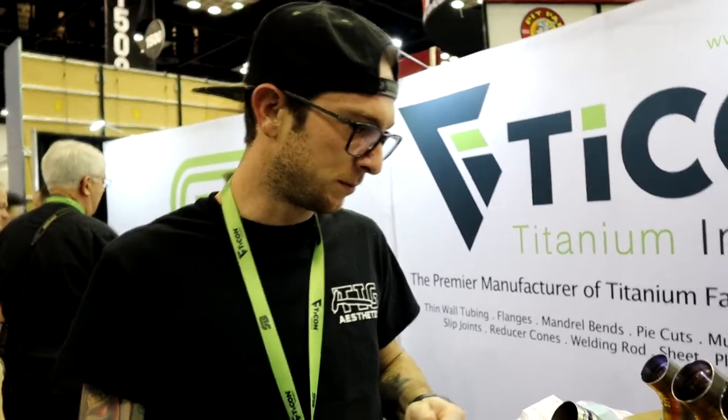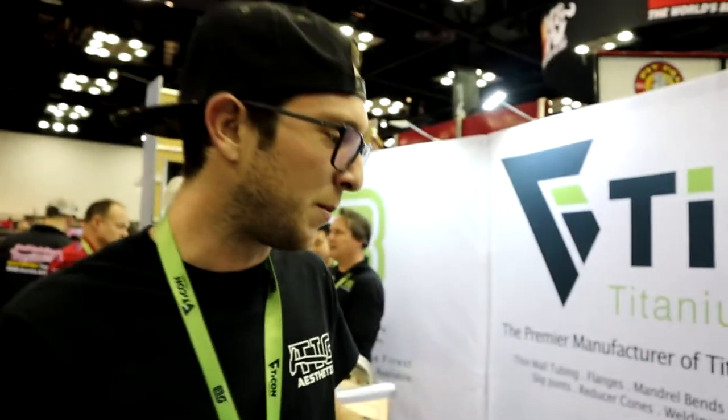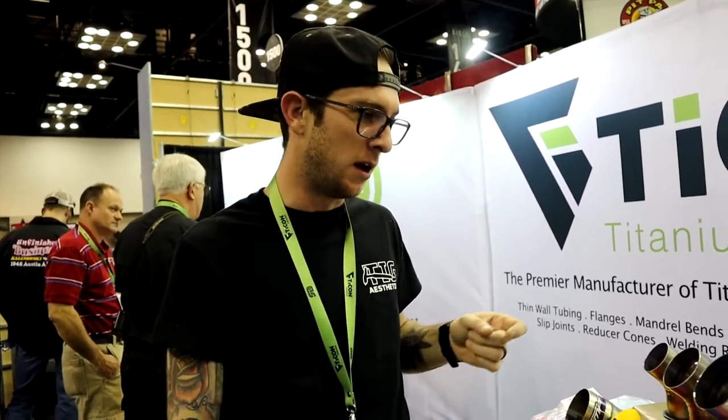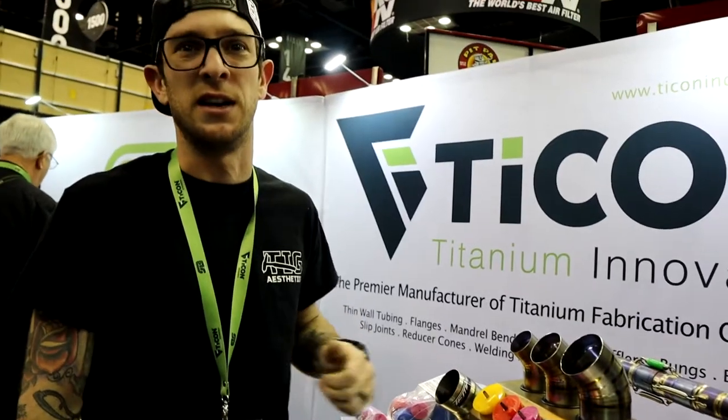So what's the point of having a back purge plug? I mean, you can use tape and stuff. I've always used tape, aluminum foil, and it leaks air around the side. It's never a perfect exact seal. So I wanted something that would seal a little better and go in and out easily, fast, and efficiently. And also the diffusers definitely help with spreading the argon out inside, getting all the air out.